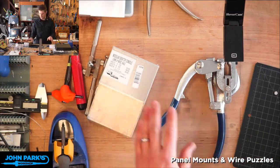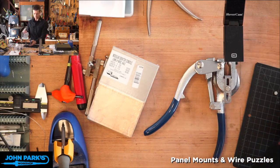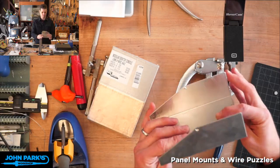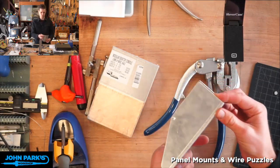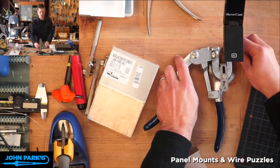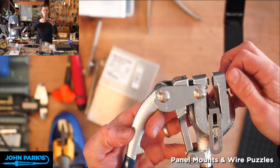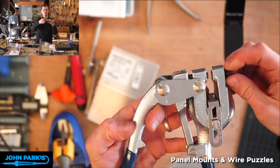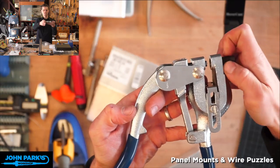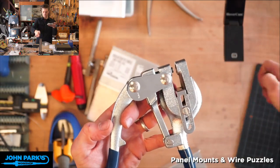I've got a fresh box that we'll use. Let's say I need to put a hole in the side, for a switch of some kind. So what you'll do is, and actually I'm going to unscrew this one for a second so you can see how that die comes out. You can see it ejected a little disc of aluminum. That was the last thing I punched through.